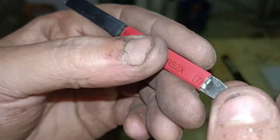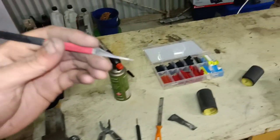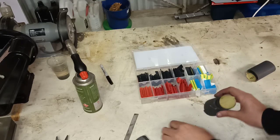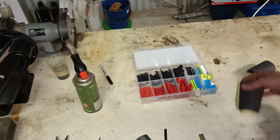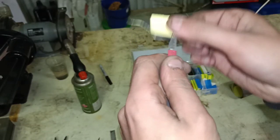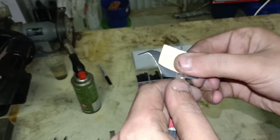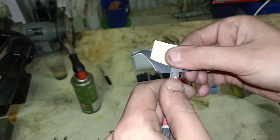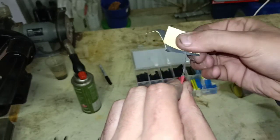There we go — quick and easy little decoder knife. I'll probably clean that up a little bit more. A great little way to make some very cheap and quite nice handles — they're very, very comfortable to use. And if I was to polish this up a bit more, I went with 600 grit, then gave it a quick bit of 1200. I did get a little bit dented in the vice, but this steel is a great thickness for making decoders. Next time I would use wood either side in the vice so as not to damage the metal.